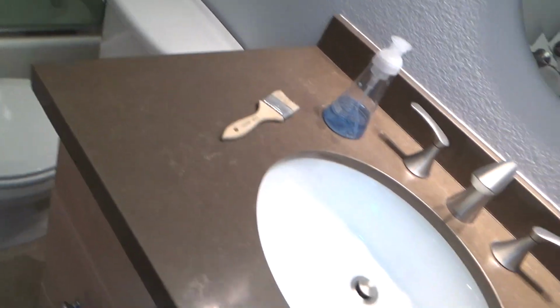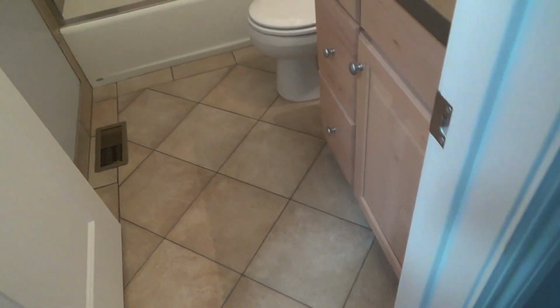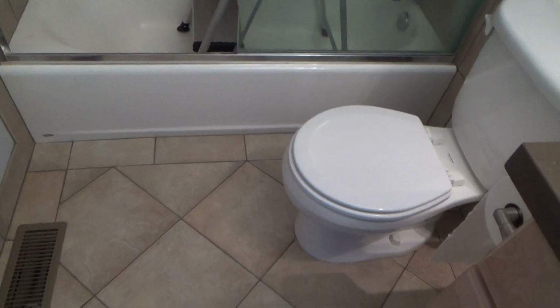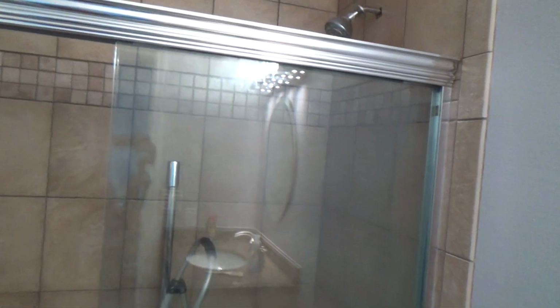How do you do this whole thing? Step by step, one little tile at a time. And yeah, that's all I used. That paintbrush right there. Now, if you've ever watched any of my other videos where I show you how to seal tile or stone walls, shower surrounds, shower floors, tile bathroom floors, stone tile bathroom floors, kitchen floors, and all that kind of stuff, usually I cut in everything with a brush, you know, that 3-inch brush or a 4-inch brush. And then I'll do the rest with a mini roller, a 4-inch mini roller with a little extension pole and a foam roller, 4-inch roller.